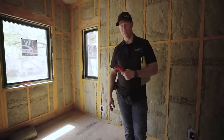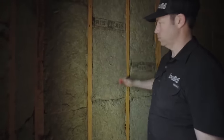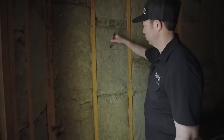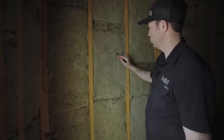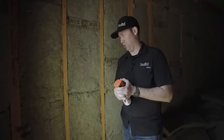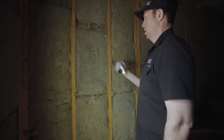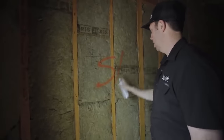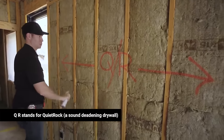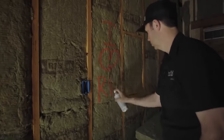One more thing I like about Rockwool: you can write on it with a Sharpie or Milwaukee markers. You can also mark walls with orange spray paint. I marked many of my walls 'SR' or 'QR' to indicate sheetrock versus quiet rock, and that spray paint shows up perfectly and takes really well on the Rockwool surface — a real benefit for builders.